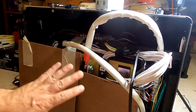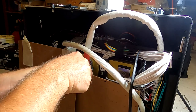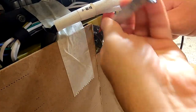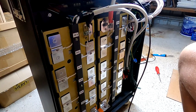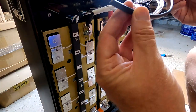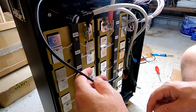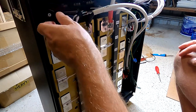Okay, I've shrouded everything off here to tighten the main positive, because we don't want to cause any drama here. So we can now take off all our barriers. And in the last step, we need to connect these two cables now to our active balancer. This was the main task actually, right? I'll leave the cable as long as it is. Who knows what we are doing with this case here in the future, and we may be thankful for having such a long cable connected.